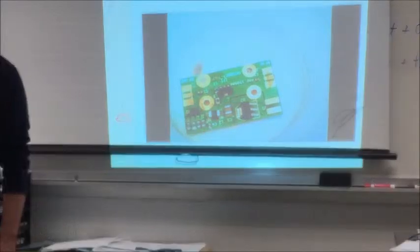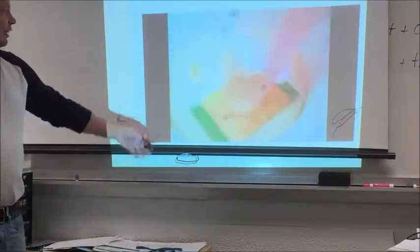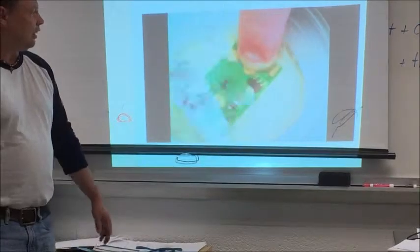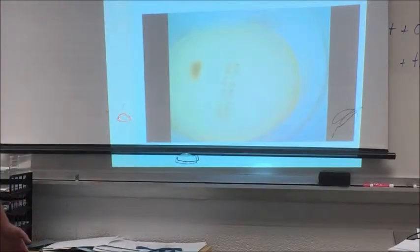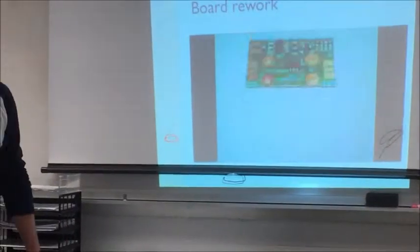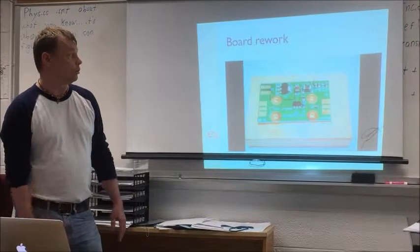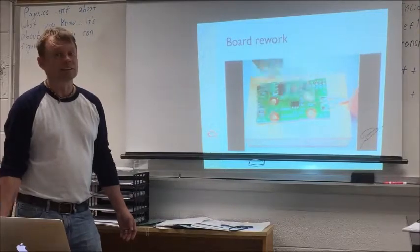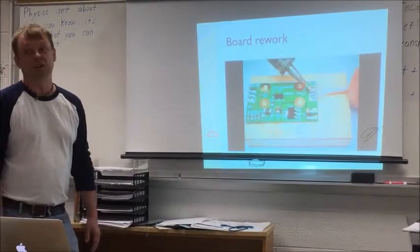I actually spilled a lot of flux; there was a lot of resin on the board, so I had to clean it. I used a plastic cup from yogurt with cereals — nothing special — and proper alcohol. You should use an antistatic brush; I'm just using a toothbrush. I rinsed it under water to wash off the dirty alcohol, then rinsed again with clean alcohol to absorb the water. Now I'm soldering the leads. Everything took 15 minutes without rushing too much.